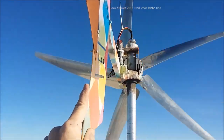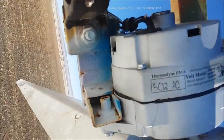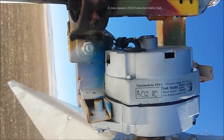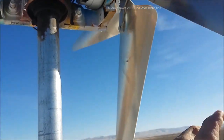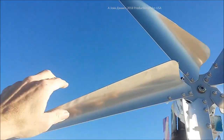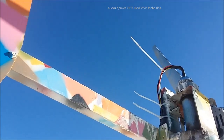For those of you who have no clue, it uses a Thermodyne PMA. This PMA turns very easy - look at that, not very much effort, hardly any cogging at all. There is a six-wire slip ring from Hurricane Wind Power right there, going in the top, using an inch-and-a-half pipe. This is how the slip ring was mounted.